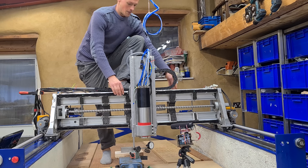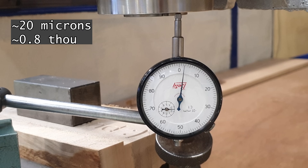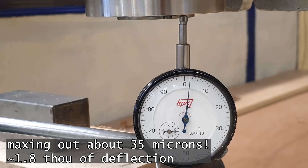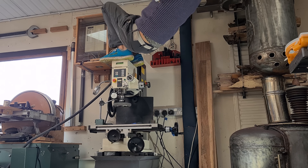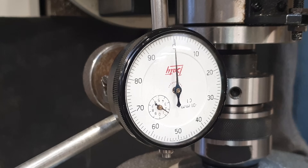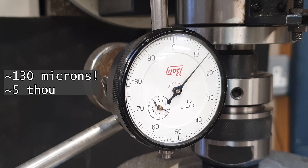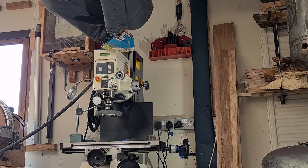How will the deflection compare with a force of say 75 kilograms? That's about 20 microns. Now for the ultimate test — the bouncing. I'm making that roughly 35 microns. Let's compare to the milling machine. The head's roughly halfway up the column. 130 microns. That is interesting.